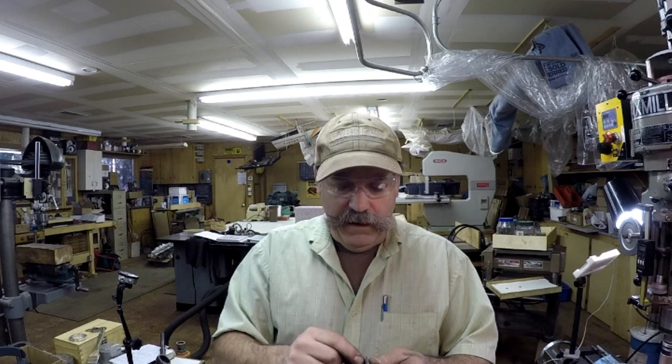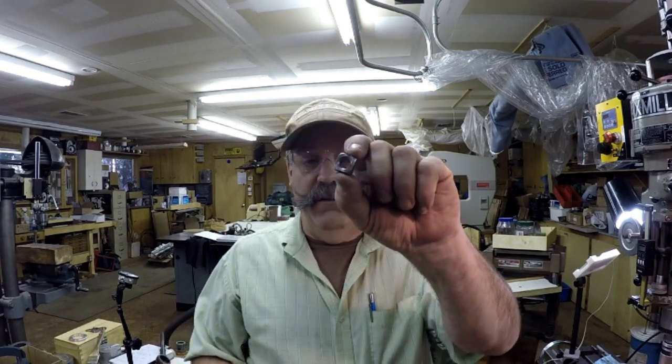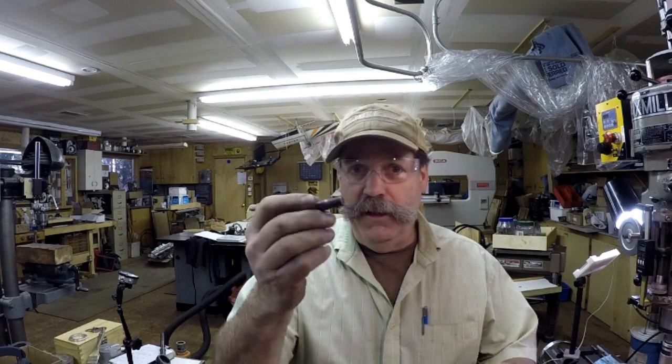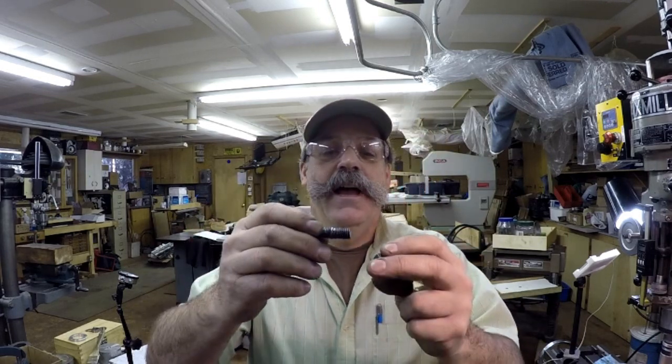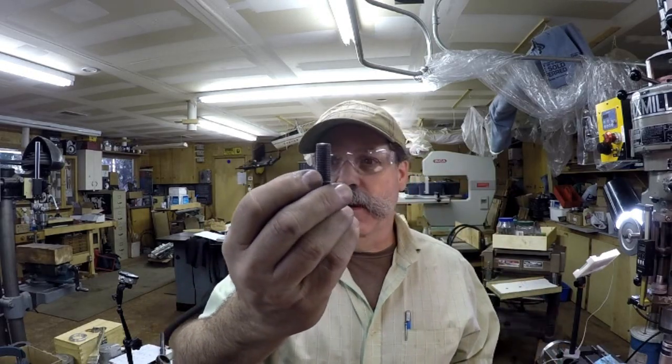And the slots actually, the base of the T slot, this fits in the top part of the T slot just fine. The base for 5/8 gave me enough clearance for a nice sliding fit of a square in the base of the T slot. So I had some 5/8 square stock. So I made 4 square nuts, threaded at 7/16 14 coarse. 7/16 is like 11 millimeters. I wrote that down even. And the top part is 7/16 20 fine threads.